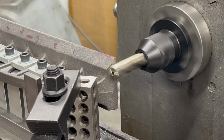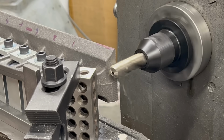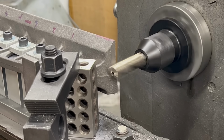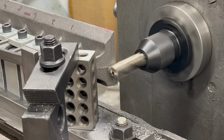It's not physically necessary for me to machine the sides of the straight edge, but it is from an aesthetic point of view. I do want the bottom of this thing to have nice, crisp, clean corners on all four edges. And in order to do that, I really feel like it's necessary to machine the sides.